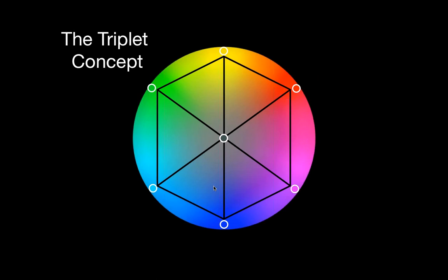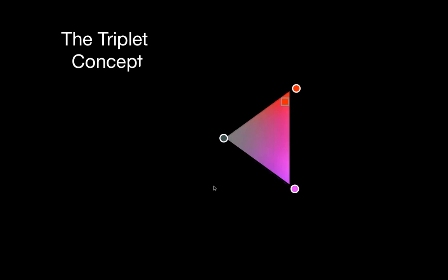Because if I was trying to match this red, let me just bring in this red again. If I was trying to match that red in the CMYK world, it would use magenta and yellow. Those 2 colors are very far apart from that red. And it might use black or cyan or both. And all those components are very far away from that red. But if we did this in the 7-color world, and we have control of our software algorithms, which we do at Esko, we will build that color with the 3 closest components.